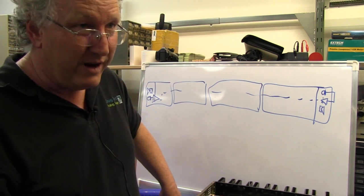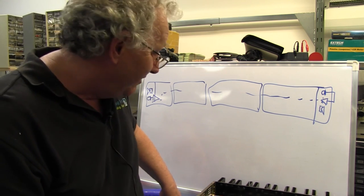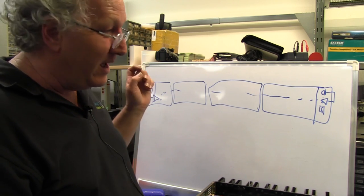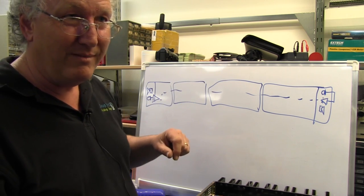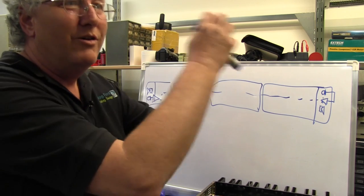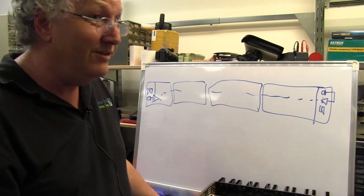They didn't. We had to create them. Oh, you had to create the generators to do that. Yep. Which actually is disturbingly easy. How do you do it? Pass a current through an inductor and open circuit the inductor. Capacitor couple the resultant spike energy onto your main rail, and Bob's your uncle. It's disturbingly easy to simulate.